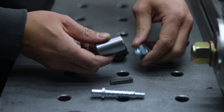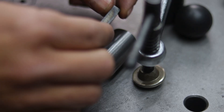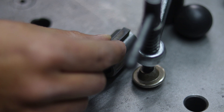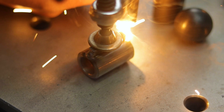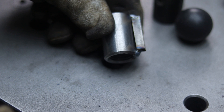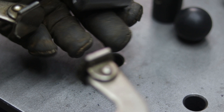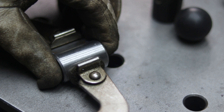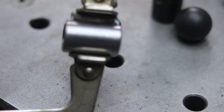We're going to take the plunger spacer and weld it to the body of the plunger. Get it centered from top and bottom and tack it in place. It lifted up on us — so clamp it down before tacking. Take one of these clamps and clamp it like this, that solves the problem. Tack it in place — it looks a lot better now.